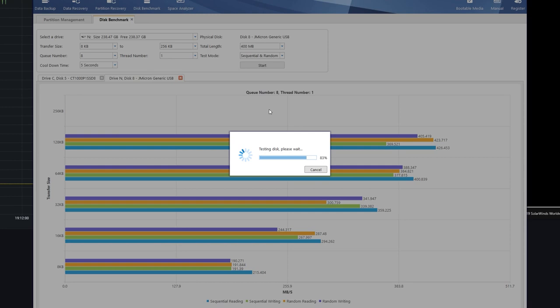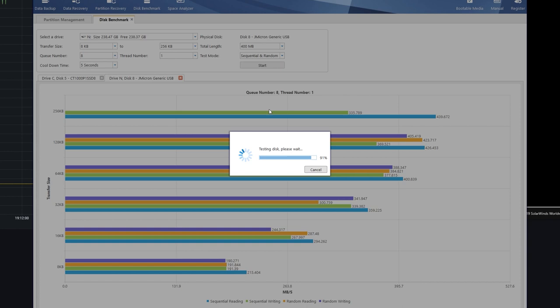So, to verify that the PCB itself isn't slowing us down, I simply unplugged it, plugged it into a PC via USB 3.0 and ran the speed benchmark. And I'm pleased to tell you that the results are within my expectations. I mean, that drive is advertised anywhere from 450 megs per second to 500, and I was hitting around 420, which is fair enough for the USB connection.